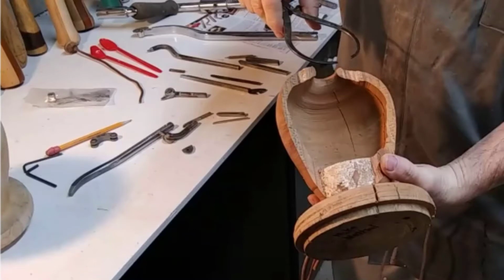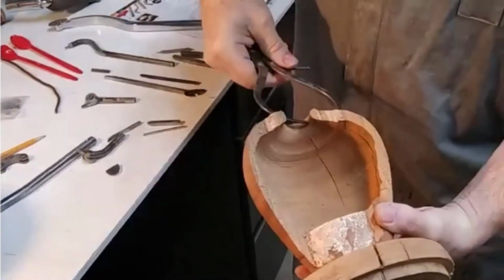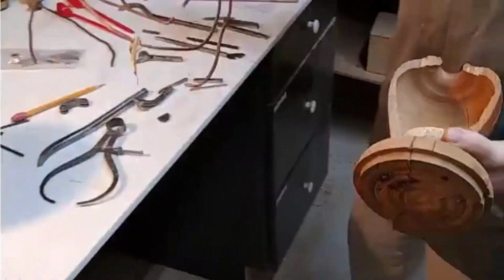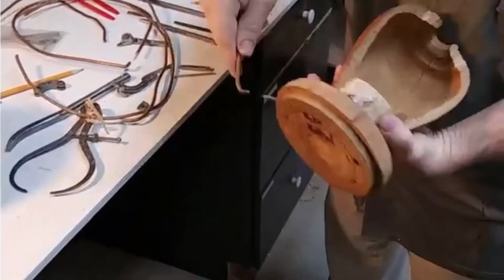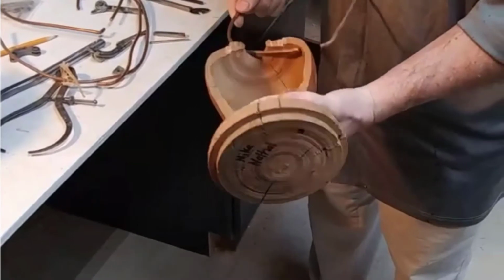Okay, so I'm leaving cutters now, and moving on to the other essential tools. The second most important tool besides the cutters are ways of measuring wall thickness. The old-fashioned way is using calipers. You can see the standard calipers, not that easy to use. I tend not to use that type. Instead, I use what I call the David Ellsworth calipers. He describes these in his book. Basically, it's just a piece of copper wire, copper rod, and you can fit it in various places along the length. And depending on the position in the bar, you'd switch it over and use different sides.